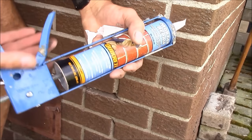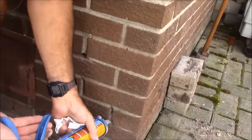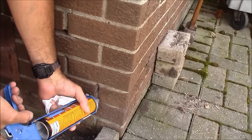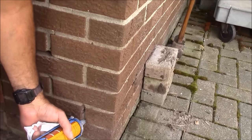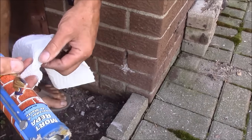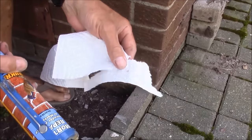So when we use this caulk, this is a water-based product. It's got a nice square tube on it. As I said, we're leaving the bottom course alone. When I'm working, I like to have napkins — I like to cut napkins or paper towels into little finger wipes.